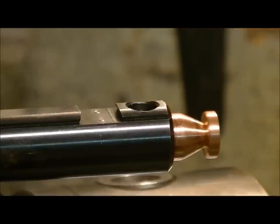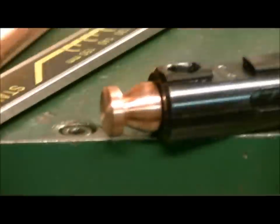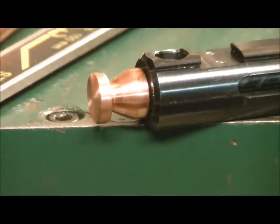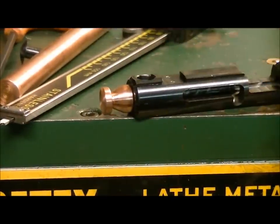I'm going to make a few more of these and use up the rest of this bar stock — there'll be different shapes. These will be posted up eventually. That's basically how you make a pellet that's also a breech plug for the 2240 and 1377 breeches — so any 22XX or 13XX gun that uses these particular breeches, these plugs work on. I will return when it's time to drill and take you through the last portion.